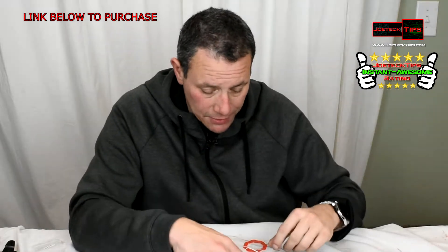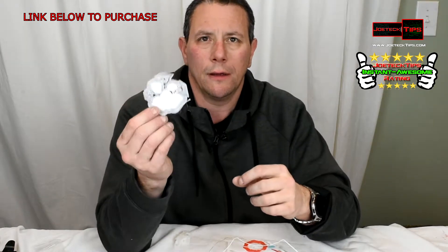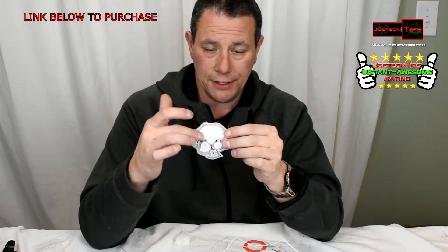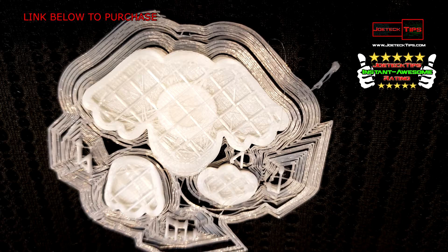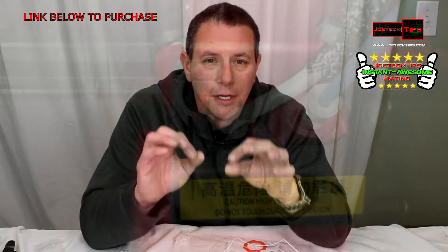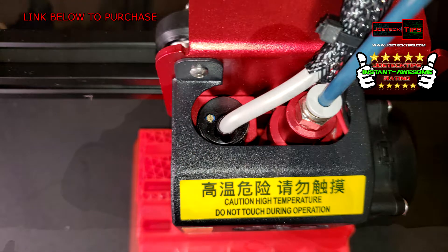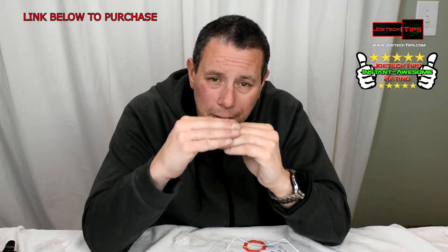I really think that the Creality CR-10S Pro is an amazing printer. Like I said in the beginning, I wanted to throw it against the wall — it wasn't working. I was printing a dog — I'll show you a picture of it. The bottom of it, the surrounding of it, was a real pain in the neck. It was not fusing properly, there were gaps and spaces, and it took a long time. There is a screw on top where the sensor is to adjust the sensitivity between the bed and the printhead. It has to get so close to the board — it has to be 0.2 millimeters away from the platform in order to print properly. I was going absolutely crazy.